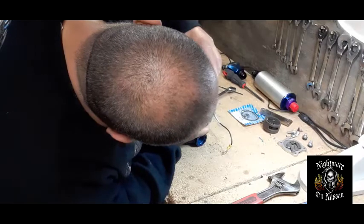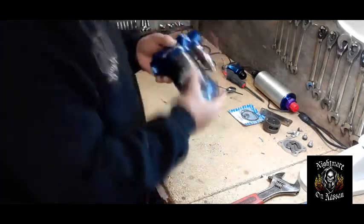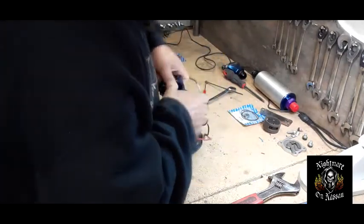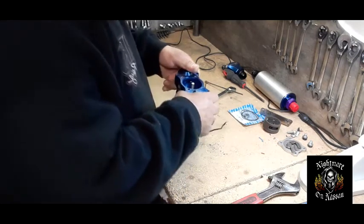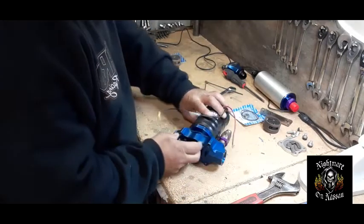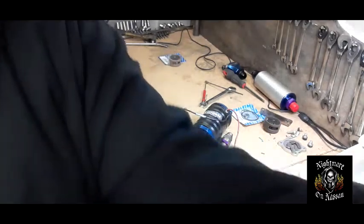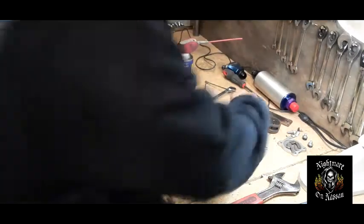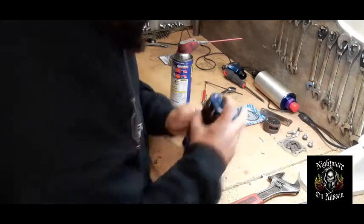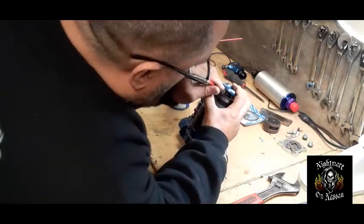So now we're going to remove the motor, just like he said — he said just lift it and it should come right up. You might have to wiggle it a little because of the bearing that's in there. I don't want the brushes to come out, because he said the brushes can come loose — and they already did come loose, but we'll be able to put them back. I'm going to have to tap it out a little bit, maybe use some WD-40.